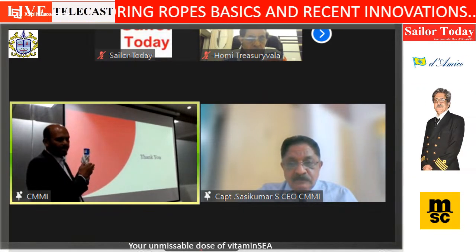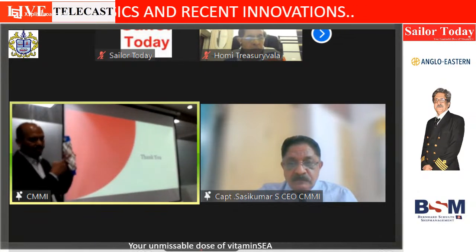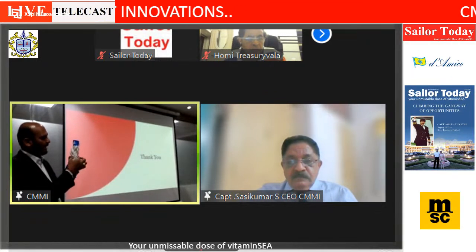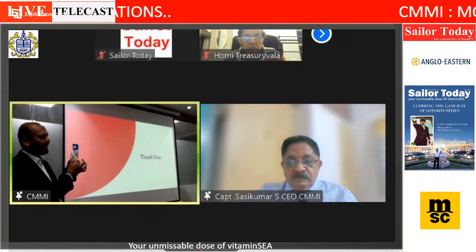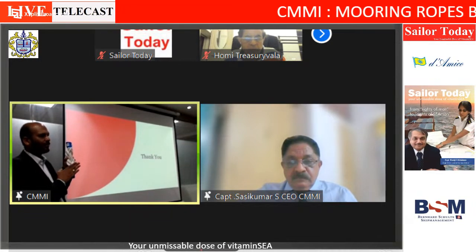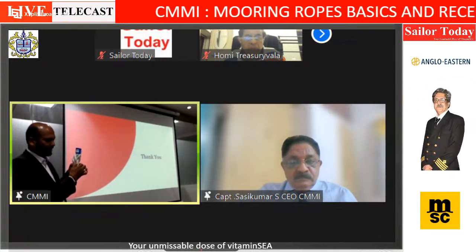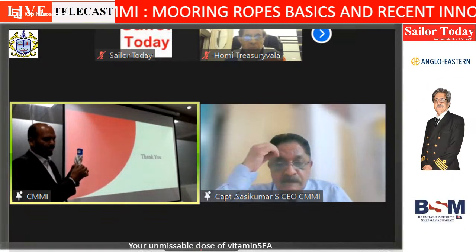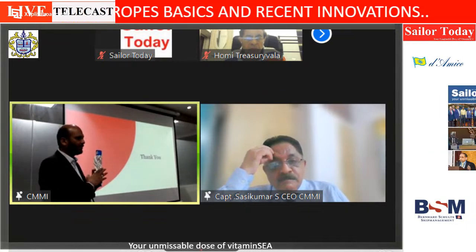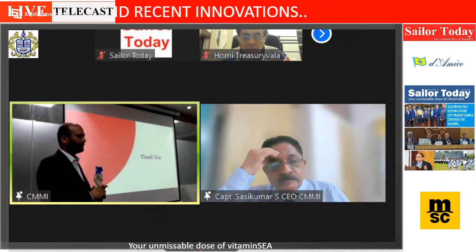Okay. The second technology, and that's an Indian innovation, is on an 8-strand rope. Two strands are of a different material. So the first 6 strands break, and then the remaining 2 strands break. When they break, they create a noise for the crew to run to safety. So these are two technologies available. This is the Indian innovation, and one is obviously the Western. They're different, they're different material altogether.